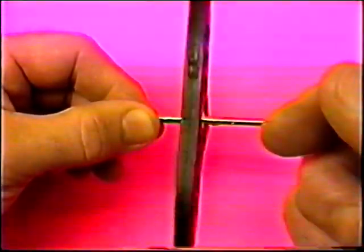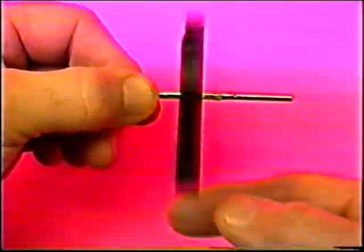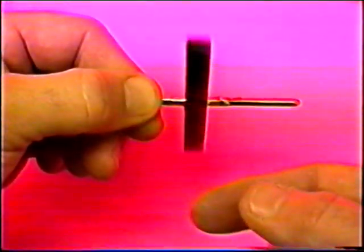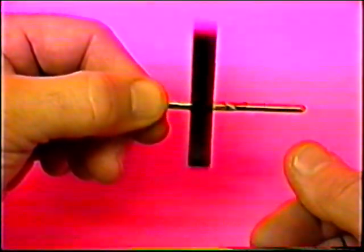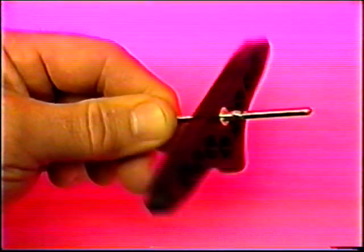Never had one of these where you don't want to use a ball bearing. A ball bearing is not good in any case where there's vibration. And if you make your own bell crank, obviously, out of Delrin or some other plastic material, make sure it's a bearing material.